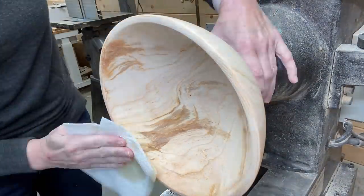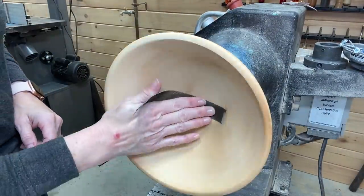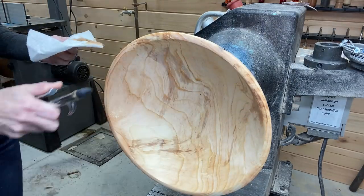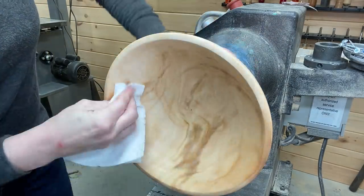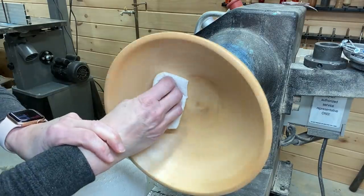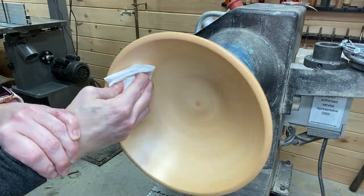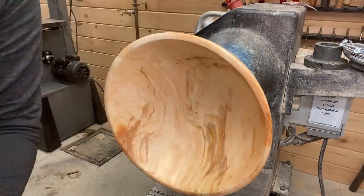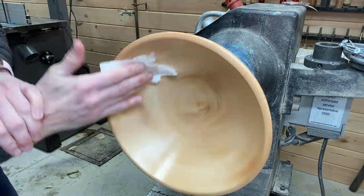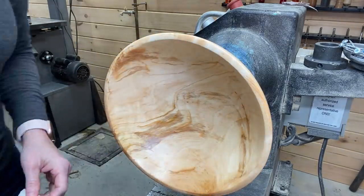So I filled those areas — kind of the wormy holes — with Starbond, and cleaned it with denatured alcohol. Sanding sealer applied, and then I'm using 600 grit to denib it. And then on to the Axe abrasive paste. There is a discount code for Axe in the video description — it's great stuff at a very reasonable price, and even more so with the discount. And the Axe polishing paste — the part I get most excited about. You'll see why in a minute. It's that easy to use.